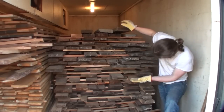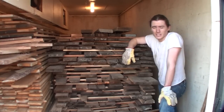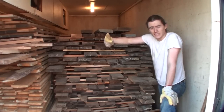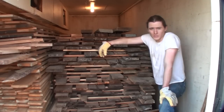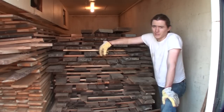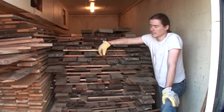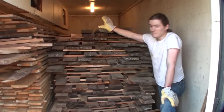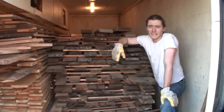The stack of wood I added today — these boards average 12 to 14 feet long. With all these boards in, the door is going to get shut and the kiln turned back on. It had already been running for the previous load up to about 150 degrees, and that kills all the bugs. We just opened it briefly to grab my wood and load this new wood in. In about two weeks once the kiln has cooled down, I'll come back and pick this stuff up. But for now it's time to take the wood I'm picking up today and turn it into furniture.